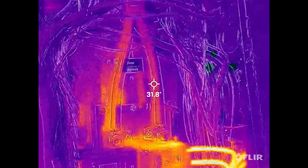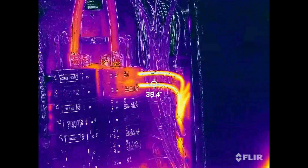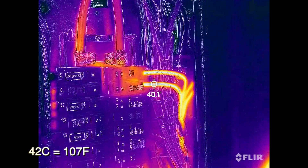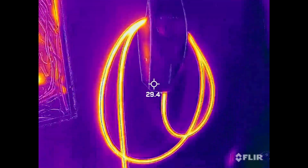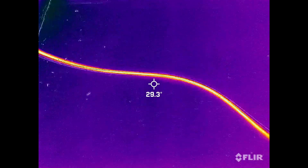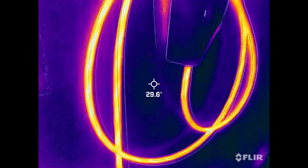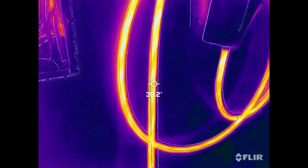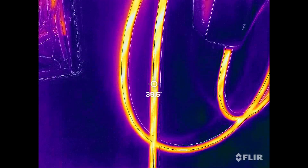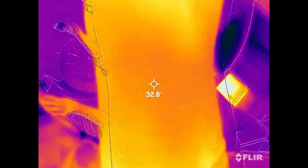You can see the main feed wires are a little warm. If I put that right on the wire, it's 41 degrees Celsius — 42 degrees Celsius. If we back it off, we can see the wire. Now it's very, very sensitive. Let's see if we can get closer to the wire. It's 40-ish, 39 to 40 degrees Celsius. You can just feel the warmth in it.